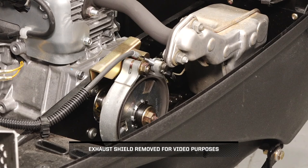Next, check the actuator linkage to ensure there is freedom of movement. Also make sure that all floating parts move freely and that all parts are securely mounted. Tighten all hardware as needed.